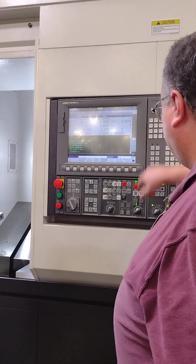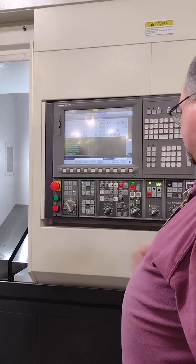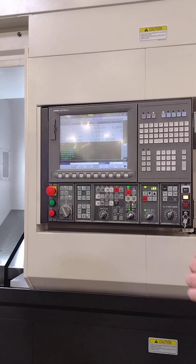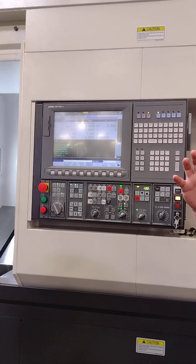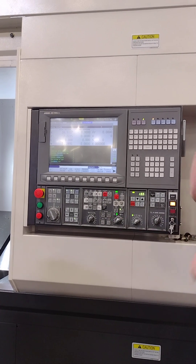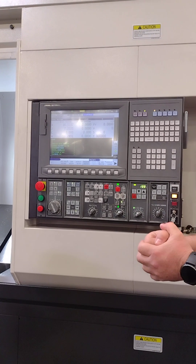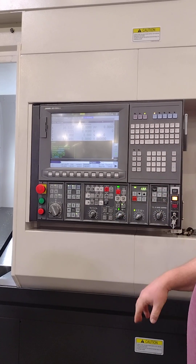If I come over here and say I'm on the main spindle and I want to orient the spindle — it looks like it's locked, it feels like it's locked, it's locked. It's indexed to a certain spot. In theory, if you're reefing on this thing and you move it a fraction of a degree, it says, 'I lost where I am, let me rotate 360 degrees really quickly and figure out where I am again.' If you're reefing on something and that thing spins on you, that's bad. So never, ever tighten the bolts that way.